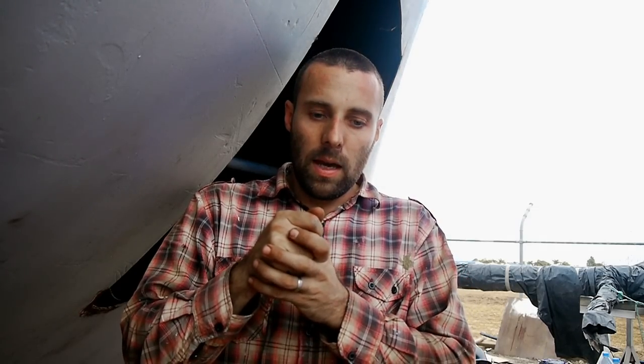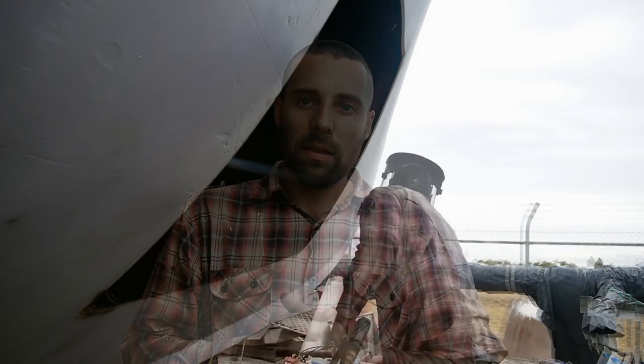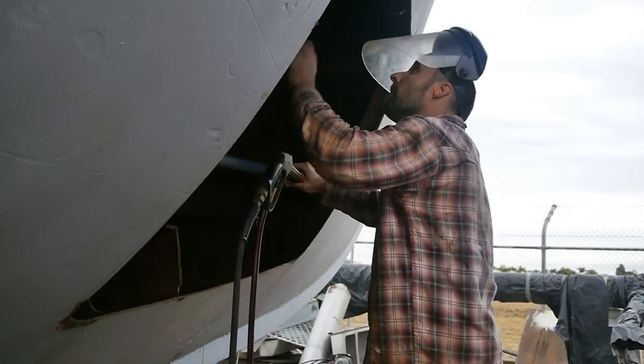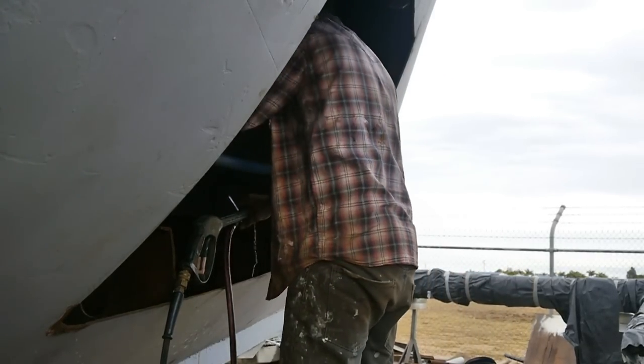I'm on a mission to solve the hole that blew in the stainless pipe. I need to get a really good weld all the way around the pipe onto the mild steel, and I'm not happy with how clean that mild steel is. We started with rusty mild steel — I got in there with a grinding disc because my sandblaster stopped working, cleaned it all up, and started welding, but I'm still not 100% happy. I've rebuilt my sandblaster and I'm going to blast a nice inch-wide strip all the way around so the mild steel is beautiful. I've also got a mirror now, which will help when filling the hole. I'm going to try to get this welded and then pressure test the pipe.